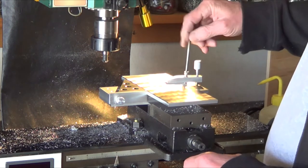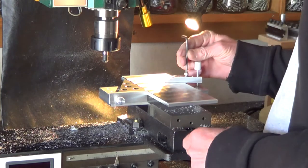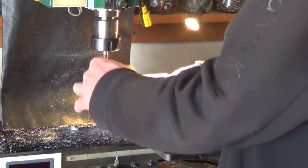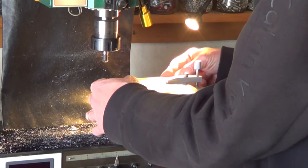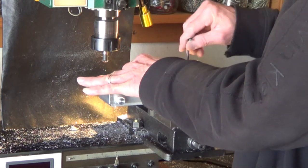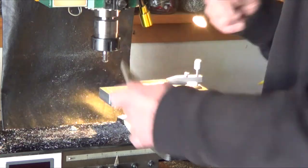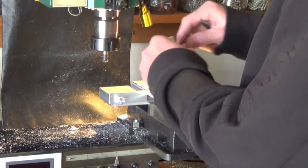Alright. Why is he binding? Alright, so take it down. Alright, snug. Alright, so I square him up. Square him up. Take him all the way back, almost to the edge. Hold it all. And clamp it down. So that's generally how I do it, because then I'm just going to put an end mill in there, and then I'll do this guy for doing the chamfer.